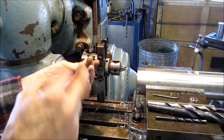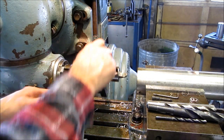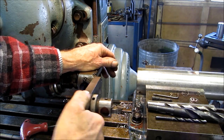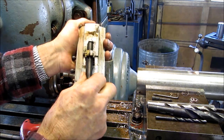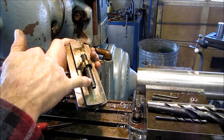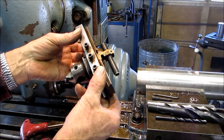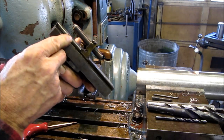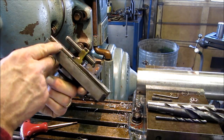When we originally got this thing 20-something years ago, it was 100% a basket case. Look at that. We broke the lead screw itself. Broke that right off. Alright, that's going to be a toughie to build. That looks like 40-something threads per inch. I made that nut 20 years ago and I thought it would be the thing that goes, but evidently it's not. I did a good job.